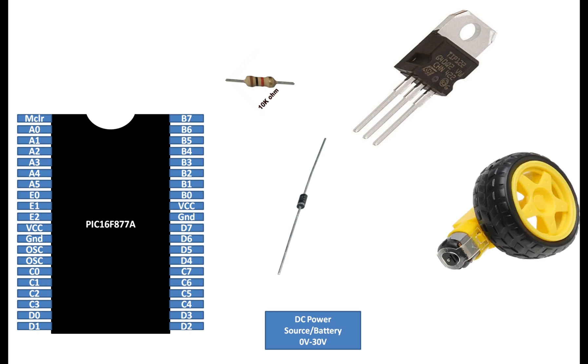The motor also has only two pins — the series motor we usually use only has two pins. For the transistor: this transistor has three pins — base, collector, and emitter. Every NPN BJT transistor always has three pins, and the labeling may shuffle depending upon the datasheet. For this TIP122 NPN, you follow this diagram. The rightmost pin from where the writing on the transistor starts is the emitter pin, the center one is the collector, and the left one is the base pin.